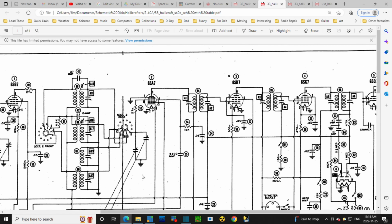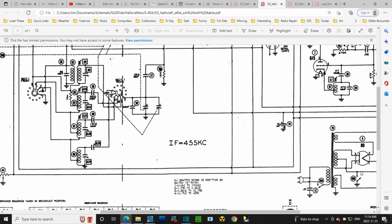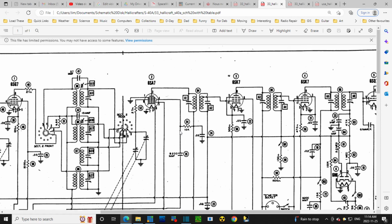Well, it's interesting finding these little differences, but you can imagine when they're forced into making this change in the power supply and move up to a more modern tube partway through manufacturing this radio. And in the course of doing that, the engineers probably said, here's 3 more changes we want to make that we've discovered we should make. And it could be right in here. Wait a minute now, you can't have a capacitor. You can have a capacitor going to ground, but you can't have a capacitor like in this line here.